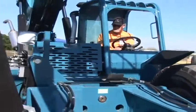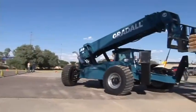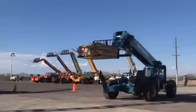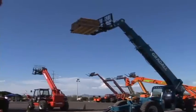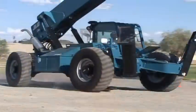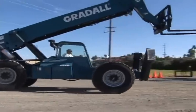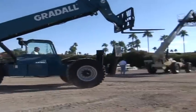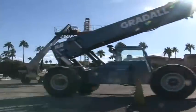It's got good access for all the service points. The Gradall also offers a rear-axle stabilization system at 45 degrees — the hydraulic fluid is reduced, so it has a dampening effect. It's not a straight lock, but a dampened rear axle at 45 degrees. There are several tire options available; the standard configuration is calcium-filled, and there are rock tires and other versions available. That's most everything that sets it apart as a different machine.